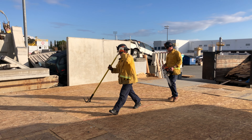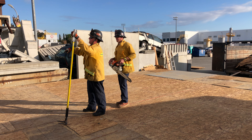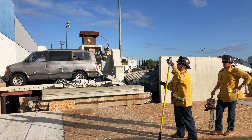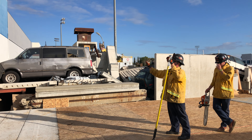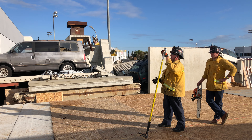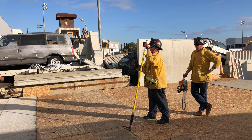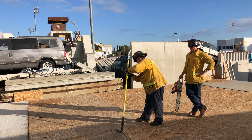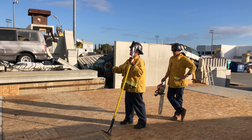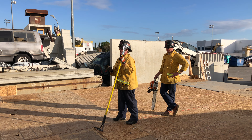This here is a decision point. If we've decided to ventilate here — maybe we have a skylight, maybe we see whirlybirds, we've been dropping smoke indicators, and now we're starting to get some smoke coming out — if it's mildly or moderately pressurized and I feel it and it's warm, that's where I'm going to cut. If I get to the point where I'm getting dark pressurized smoke and it's hot, I'm too close. Remember: off-beam, space for time.